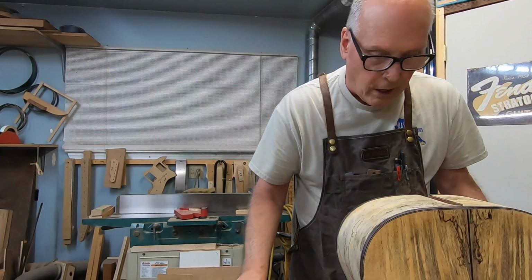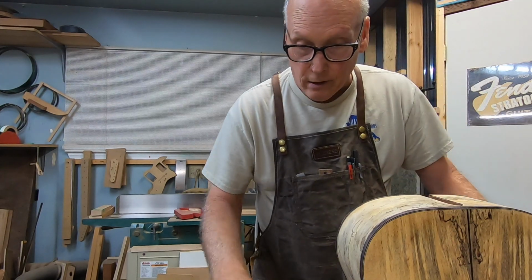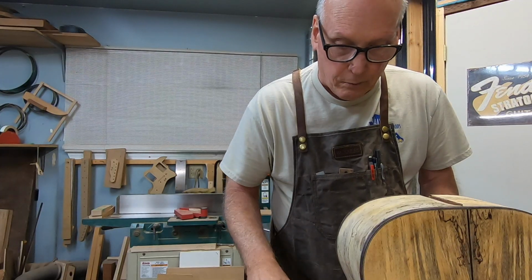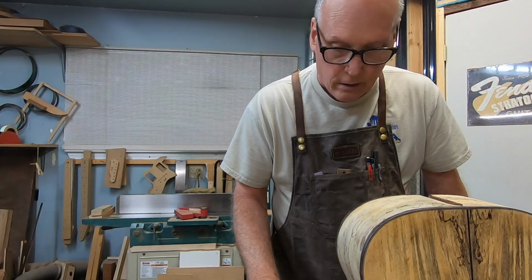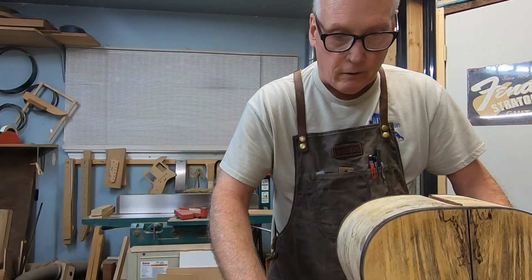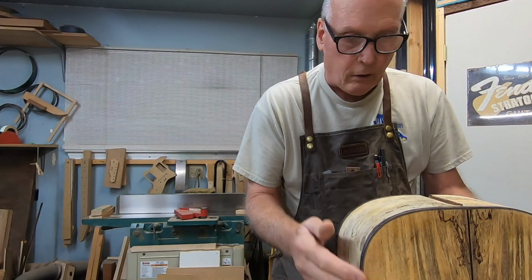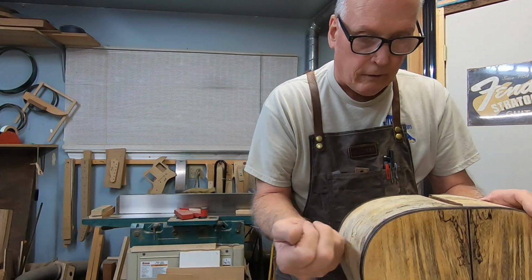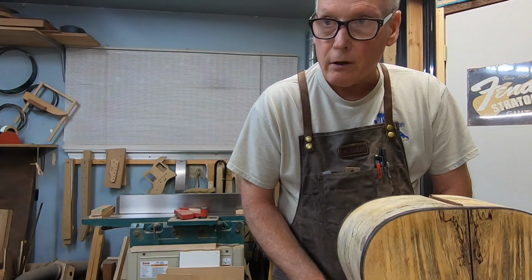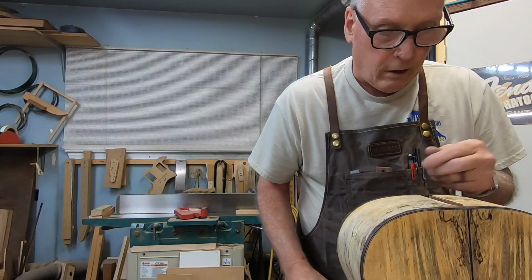The thing with the Moxon vise is that they're typically flat-jawed, and you use them as a woodworking vise. But if you build guitars, you just basically take that 15-foot radius out of each face, so that you're always clamping down on the edge of the guitar. You're never trying to flatten the guitar out with a flat clamp. So they grab the edges of the guitar, and on the top side, it grabs the edge only, because that's a 30-foot radius, 28 in this case.